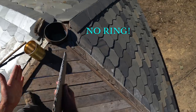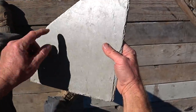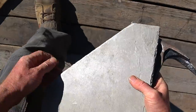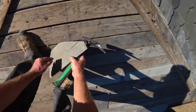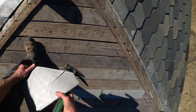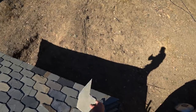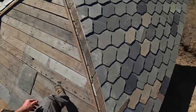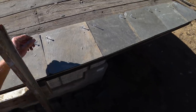This sounds a little funny - look at this - and it goes all the way to here. I hit it because I don't want to find it later and try to use it again. If you want to throw a slate off the roof without breaking it, throw it on its edge - not saying it won't break, but it's much less likely to break. I'm out of reasons not to drive these nails home - everything's set up and it looks really good.